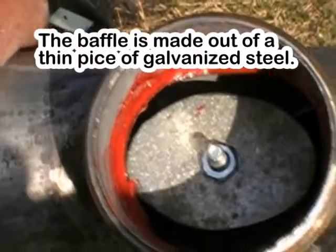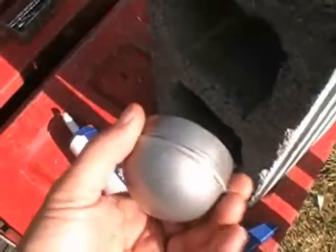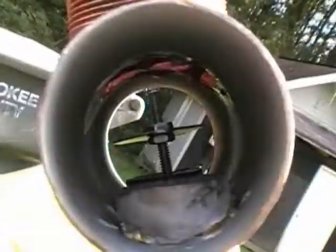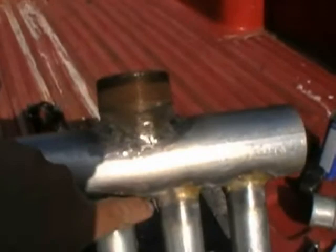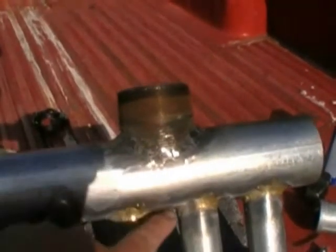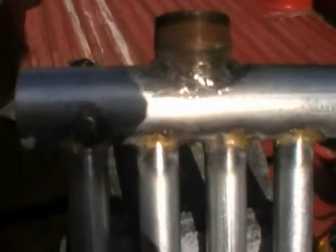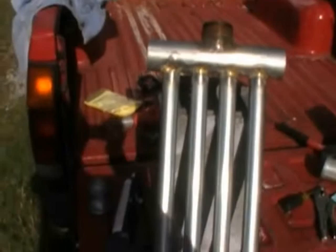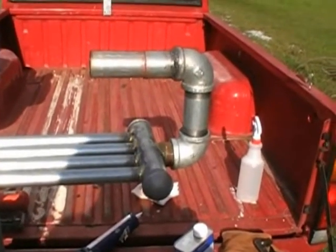The internal baffle is almost a football shape - I'll give you all the measurements of how far up I've got it raised and the diameters. Looking at the side view you can see inside of it. For the baffle mounting I used a two-inch screw run straight up through the bottom, put a nut on it and bolted it down, then brazed the top of the screw head so it can't free-spin and won't rattle loose. Now let's get to spray painting this thing and setting it up on the gasifier.